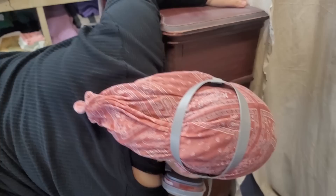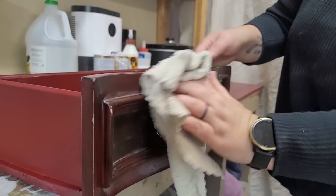After all the scuff sanding I wiped the dust away with a cloth, then came back with a clean, damp, lint-free cloth to remove any remaining dust residue.